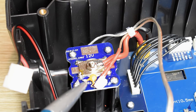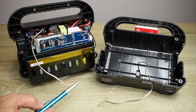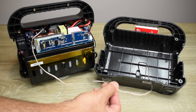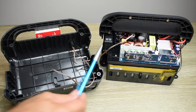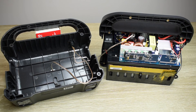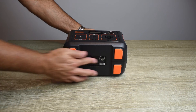There's a little bit of adhesive here to keep things from moving, as well as a nylon tie. Let me put the battery back into position and connect everything up. I'm going to take the copper-colored wire and solder it to one terminal of the switch; the other switch terminal goes to the copper-colored wire that connects to the positive of the COB LED light panel. The silver wire on this side connects to the silver wire on the other side. This is what it looks like all soldered together — there's excess wire so I can lift it up and out of the way of the battery pack. Here it is all put back together, with the feet glued back on.